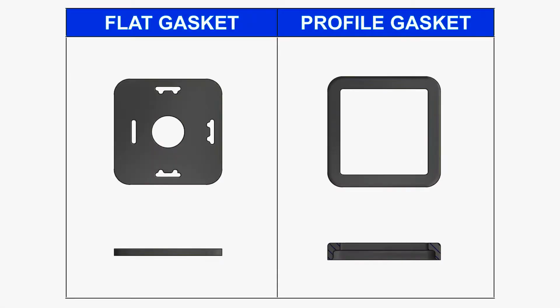It's primarily used with hydraulic valves, so it's compatible with oils, machining process fluids, and cleaning agents. And it complements two of our most popular product lines, the 5J and 5F. The difference is that the 5K is offered without the integrated gasket design to promote compatibility with our MCCR Multiple Control Connector Receptacle and ILW series, Interposed Lighted Wafer.